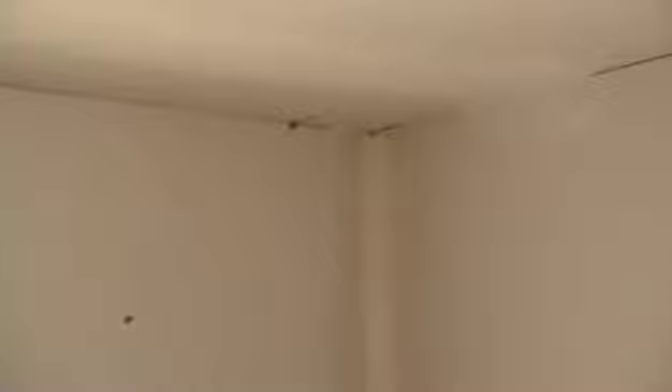We'll fold it up to do the corner - it folds very well. Then we go and place it. I place it at the top, maybe a half inch short of the ceiling because the other corners will be coming to it. Then I work my way down and bring it an inch short of the floor - the baseboard actually meets it there. Now it's a matter of wiping this piece of tape. I go to the top and put a little bit of mud on the end of my knife to make it slide on the paper very well. Tilt that knife up, push hard, and take it right to the bottom. Turn around to the other side, borrow that little bit of mud to make it slide better, go to the top, tilt that knife up, and push hard right to the bottom. Wipe off and clean up your baseboard at the bottom. It's nice and clean and ready for the next coat - no sanding required.